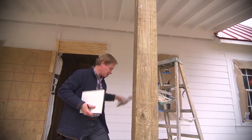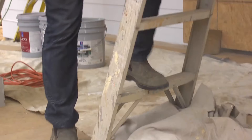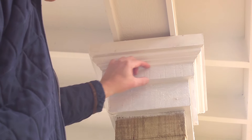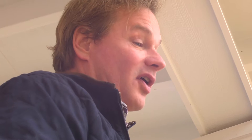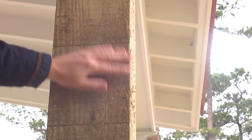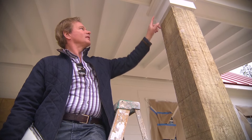What I want to do is show you what we did here. We have about 4 inches of collar here, which actually goes up behind here, a 2-by-1-inch piece here, a little trim mold here, and then a block at the top. We're trying to follow some classical proportions — this is a rustic farmhouse, so we're not being a slave to Palladio or anything. He's gonna chamfer the sides of these posts, and we're gonna do a coarse sanding. I don't want all of the grain to go away, because it really matches the grain of the materials we've used to trim out the whole house.